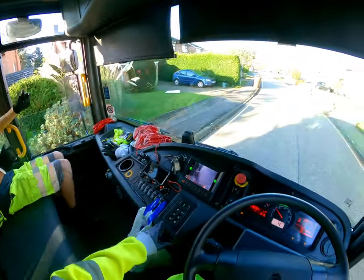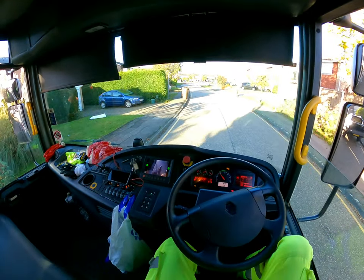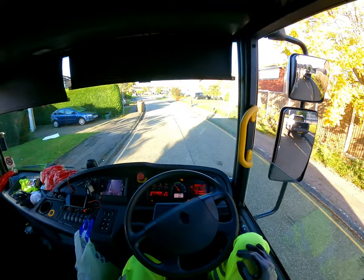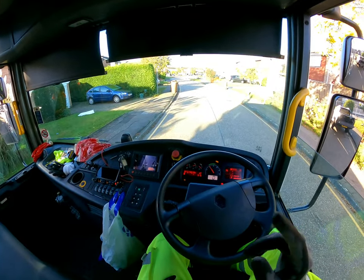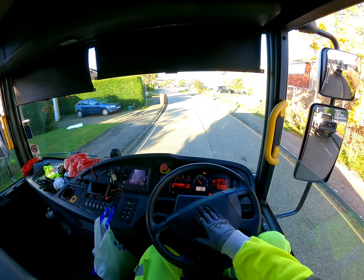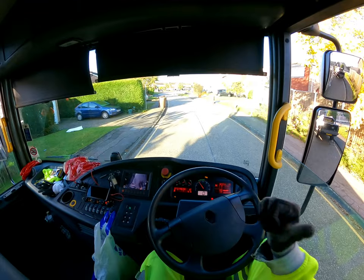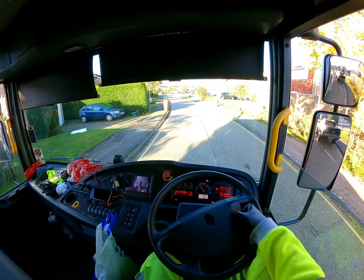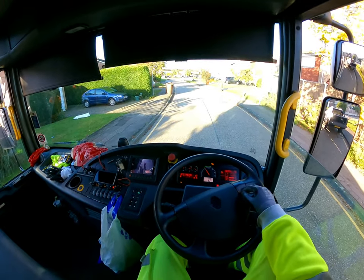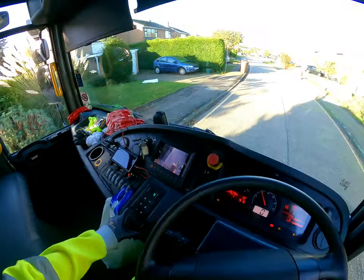However, this being brown waste, it retains a lot of liquid in the grass clippings. So although the volume of the vehicle gets filled up, you could exceed the weight long before that. Where I'm working presently, on the garden waste rounds, 6 black domestic crews, 6 brown bin garden waste crews, it would appear that the garden waste lorries are throttled back in their operating pressures. So the hopper blade will cut out normally about 23, 24 ton, to save on breaking all the pipes and rams, trying to compress an enormous mound of wet mud, grass, leaves, branches, all manner of biomass material.